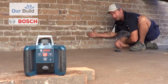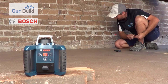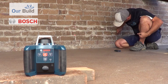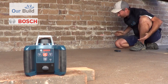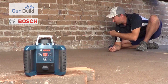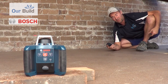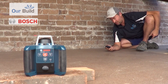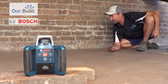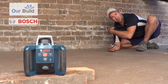I've got the laser just oscillating here side to side, cutting through about where my hand is now. The good thing about that is you can just put a mark up this end. And with the remote — which is really cool — you can move that oscillation up the wall, so it's slowly starting to creep up. Not only that, it's got a function where you can make the spread of the beam go a lot wider. Press that a couple of times and it throws about a two and a half to three metre spread from side to side, so it's handy if you need to get a longer line.